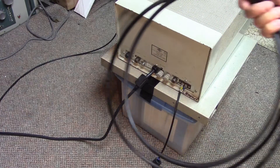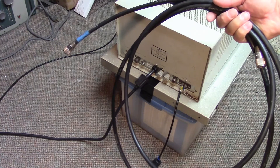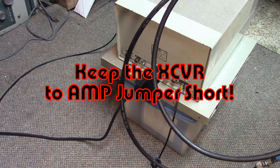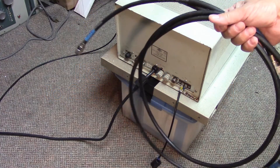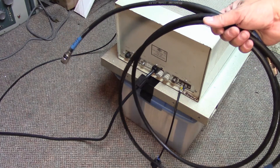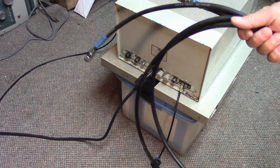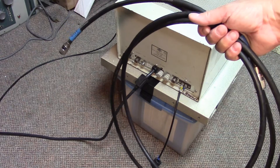The other cables you need are your RF jumper cables that go between the rig and the linear, and then to your SWR meter or tuner. This is some RG-8U — old-fashioned jumpers, but they'll work fine. A more modern coax cable might be LMR-240 or LMR-400. Going between the transceiver and the linear you can use smaller coax, but once you get into linear power you're going to need coax that can handle high power at low loss.